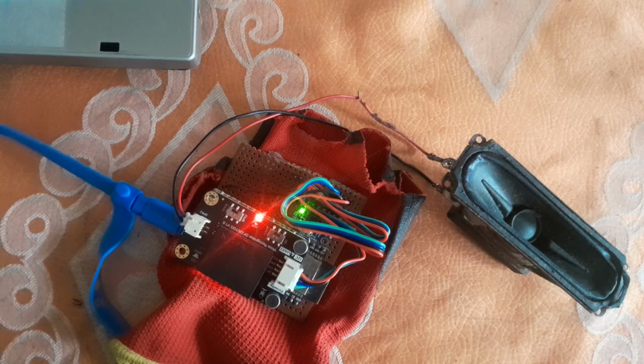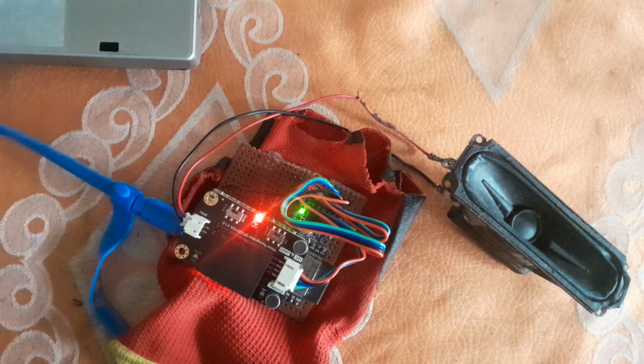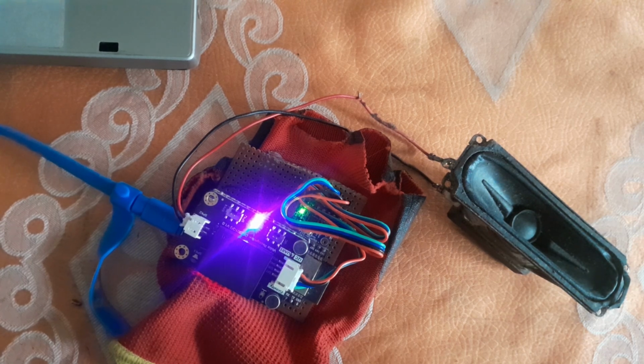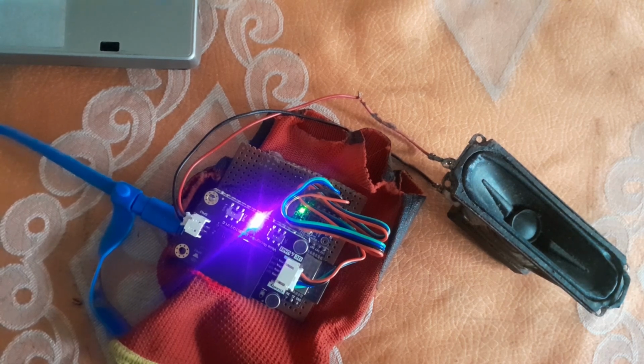To delete, I just say I want to delete, but first I have to wake up the DFRobot. It's asleep. That's why the blue LED, which is supposed to be on here, is not on. So I just say, hello robot. Hello, robot. Yes, I'm here. I want to delete. Do you want to delete the learned wake word or command word? Wake word. Delete wake word. Deleting successful. Okay, now I've deleted the wake word I trained on it.